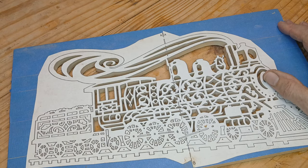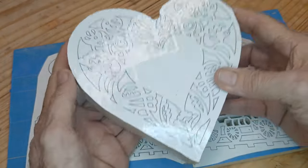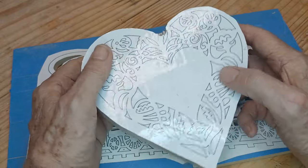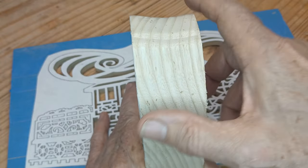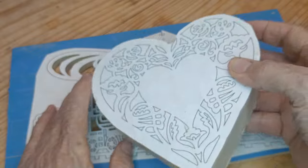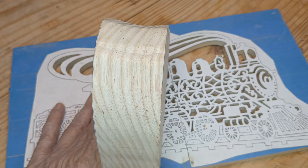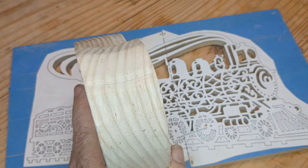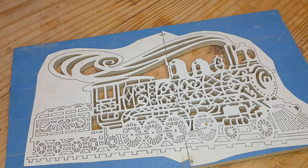Now thickness is a very important consideration. I've got a piece right here — this is ash. I cut this making a box, cutting the walls of the box out of it. What can happen if you use too small a blade and go too far without changing it — because it gets dull — you get this problem. I used a 7; I should have probably used a 12, or at least a 9. It cut fine over here, and I changed blades part of the way in, but I pushed the last one too far and went around that corner too fast. You've got to cut slowly and carefully in thick wood like this, let the blade do its job and keep a fresh blade in. That was salvageable because it was inside the body of the box and I just had to sand it down.